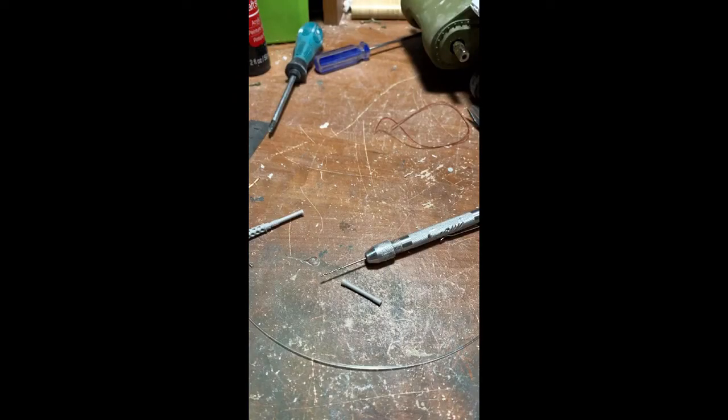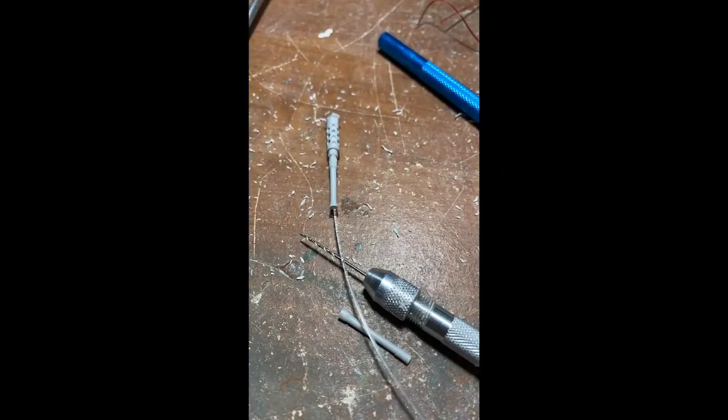So in order to accomplish this, the gun had to be cut up in three parts. So you had the end of the barrel, the mid barrel, and then the weapon itself, after the barrel. And this gave short enough areas so that you could use the little micro drill to drill holes through these little barrel parts, be very, very careful, and run this little fiber optic tubing from one end of the gun to the other. And I'll show you in the next slide how that was done.